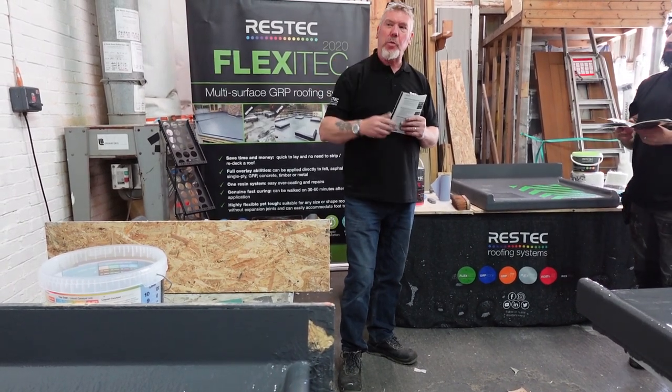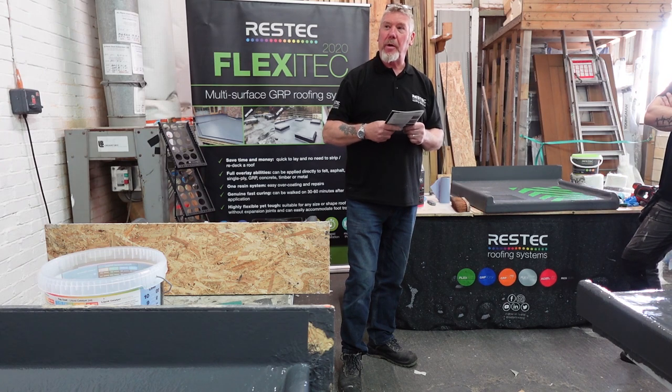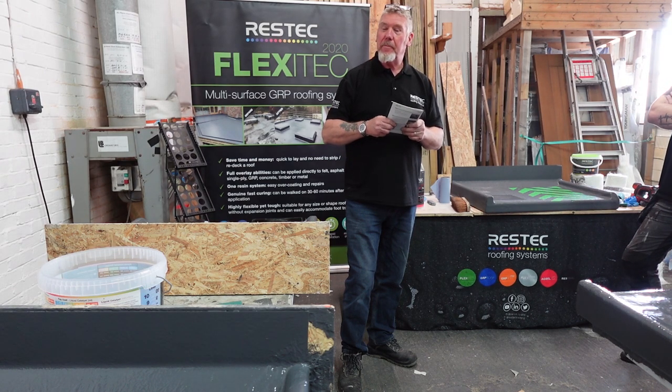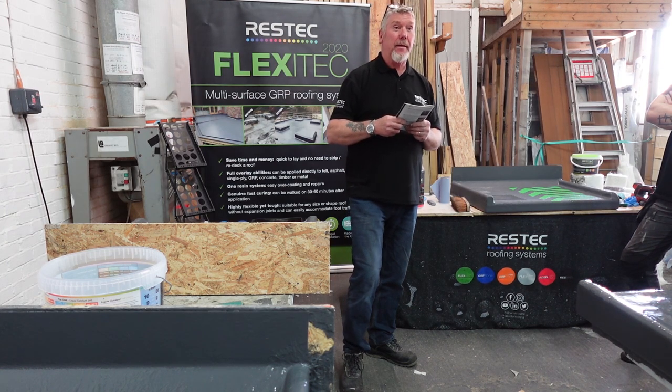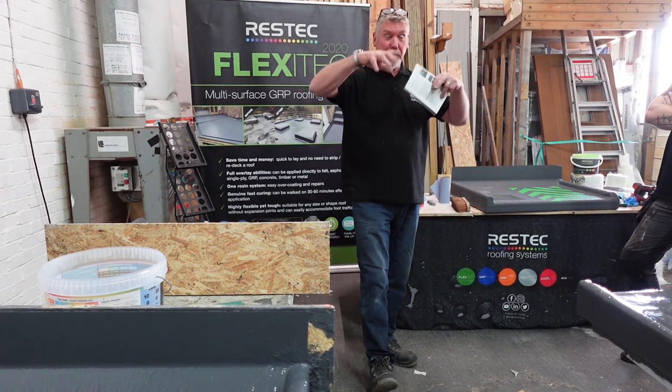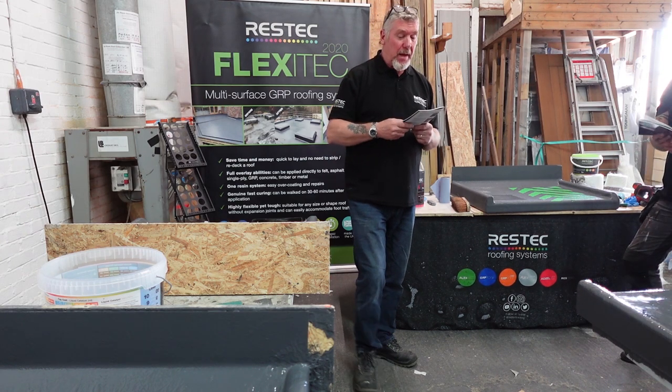If you put concrete onto a metal deck, a corrugated metal deck, how long do you think the hydration period is? It's longer. Twice as long, because it's only hydrating because it can't dissipate. So if you've got a metal deck, then you've got a problem with the client. Okay.